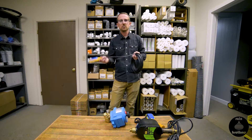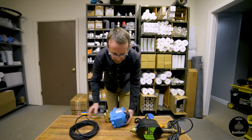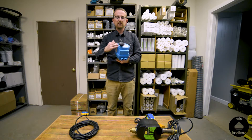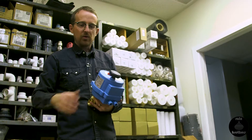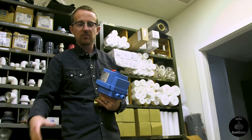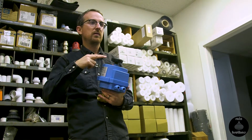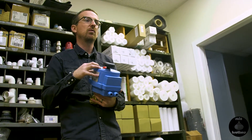The reason we need a two-way switch is that we need this motor to be energized at all times. There's no default to close or default to open — it is energized to stay in one position or the other. We always need power coming in, because if we used a single-pole float switch, we would eventually get separation of the circuit and there would be no energy getting to the motor.